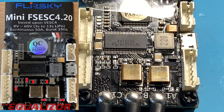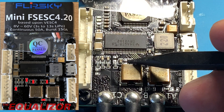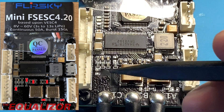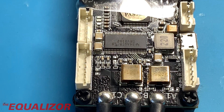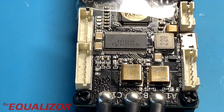My boss has already removed the resistors — they came from there, there, there, there, there, and there — and what we're going to do is put on some replacement ones with the correct values. These are 0603 resistors so they're pretty darn small, but I'm going to hand solder them. I was thinking of using hot air but decided against it; I'm going to manually solder them using my JBC soldering station.